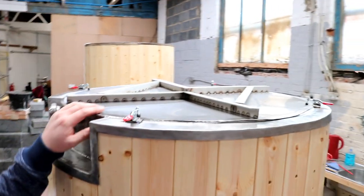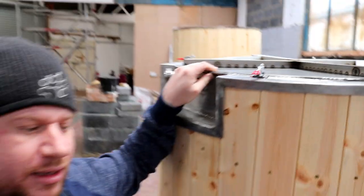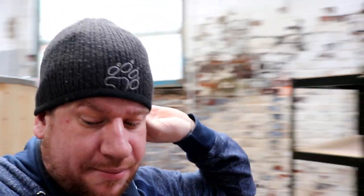We've got that lid on — I think we're going to keep that lid for the HLT. I'm not going to revisit the lids for everything else in terms of polycarbonate or acrylic until I've played with these stainless steel lids, because I want to weld some spray ball connectors into the centre of the lid. If we've got perspex, I'd have to put some type of bulkhead fitting on there to hold it in, which I don't want because it's going to harbour yeast and crap.